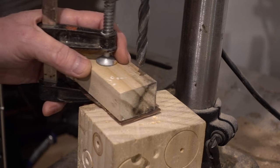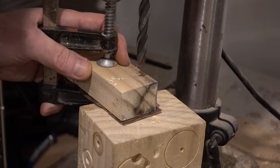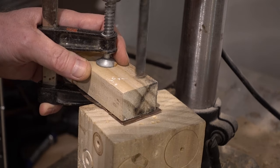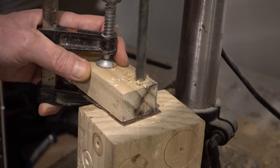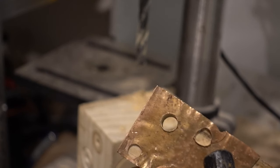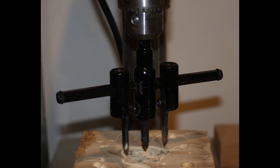My solution here is to clamp the copper sheet to a piece of wood which has the right diameter hole drilled into it and can act as a jig. If the hole position isn't critical then you can just drill through both together as here. For holes of diameter 15mm or more you will probably be using a hole saw or some form of adjustable rotating scribe like this. These do not make quite such neat holes as twist drills. For solder to be drawn into a joint by capillary action the joint gap should not be more than about a quarter of a millimetre.